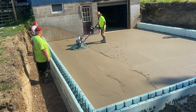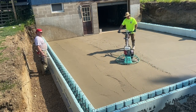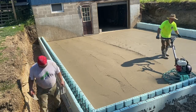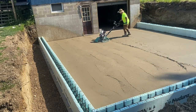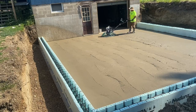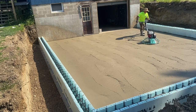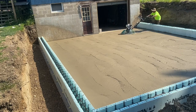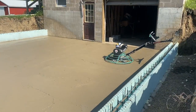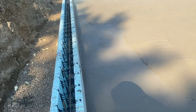I like to get out on these floors as soon as I can step out without leaving a very deep footprint. The concrete's still pretty soft. I run the power trowel pretty slow at first — you don't need the engine revved right up, and you don't want the blades tipped too much, you kind of want them flat. This is that quick pitch trowel, so it's a lot easier to adjust the pitch of the blades. I just hit it for the first time and I'm staying out of that corner where we ran a little bit short.